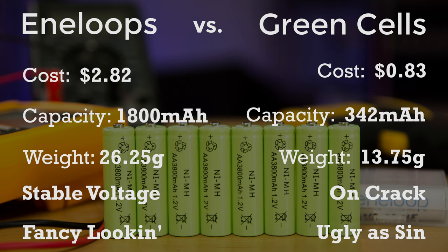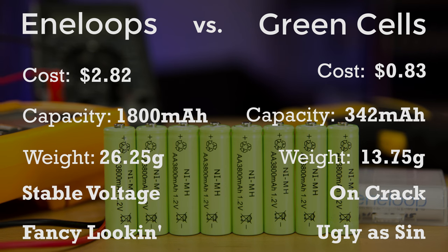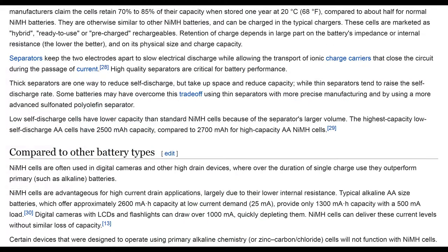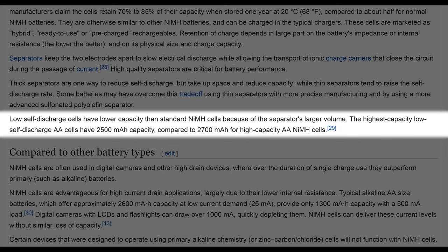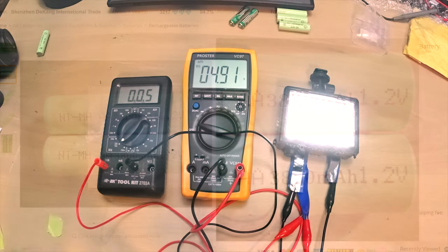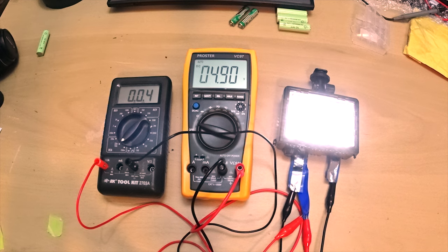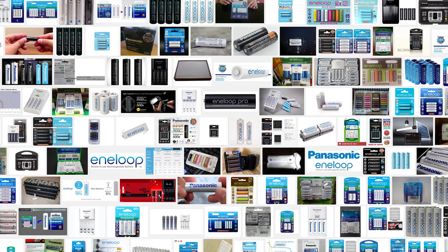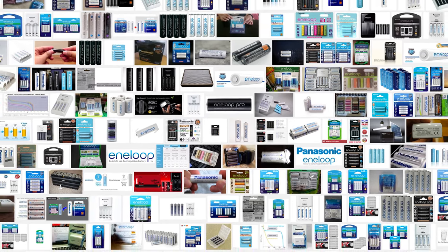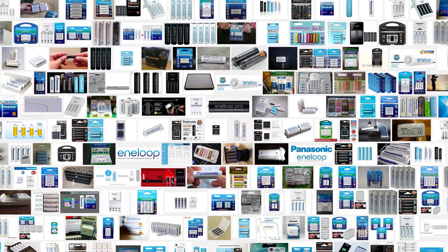It shows that either the random green cells are really inefficient, or they're not actually nickel metal hydride cells at all. The random off-brand manufacturer is clearly lying about their specification of 3800 mAh — I believe it's not even theoretically possible to cram that kind of energy density into a double-A size package using NiMH technology. The seller's quite obvious photoshopping of the product photos adds a level of shame that is really deplorable. The Eneloops, on the other hand, appear to come in right around their specified 1.9 amp hour capacity. My testing undoubtedly didn't mirror their official spec conditions, but it's obvious they're not a scam in any way. I didn't make this video as a review or endorsement of Panasonic — there are undoubtedly great NiMH cells out there, some of which could match the Eneloops for quality and maybe beat them on price. But this really goes to show the merit of the old adage: you get what you pay for.